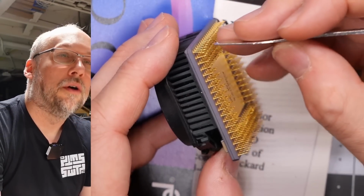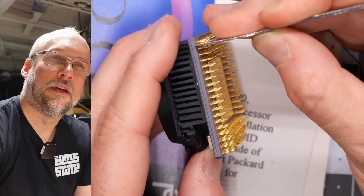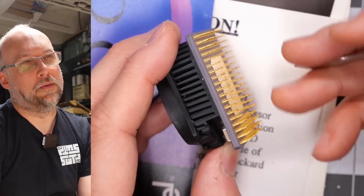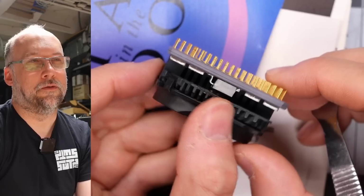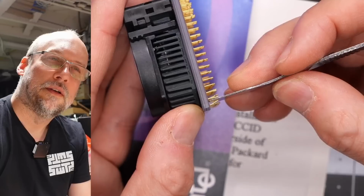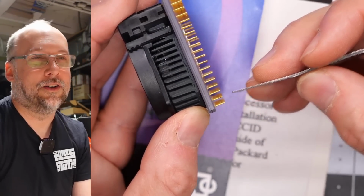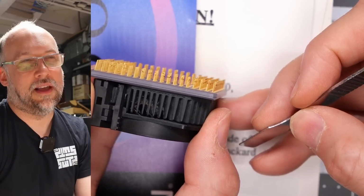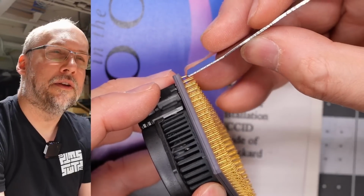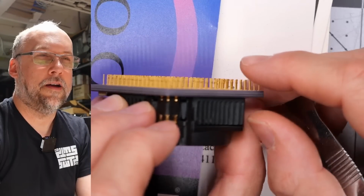As far as straightening pins go, my technique, and I'm going to use the camera here to do it, is I use this little tool here, and we just sort of bend the pins back very carefully like that. And then you want to look at it from all the different directions, because you see this way, we still have some pins bent. Now again, I'm doing this through the camera, so it's not ideal. It's better when you use your eyes. But without my goggles on, I won't be able to see very clearly. But yeah, see, that's a lot better. And then you can look at it at an angle like this as well and look for any pins that are bent. Here, this one here is bent as well, just ever so slightly. You just want to make sure everything is the same from every angle.